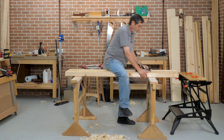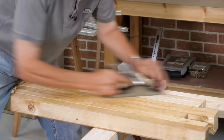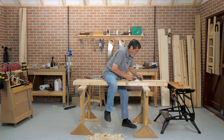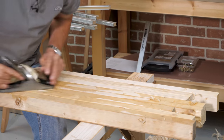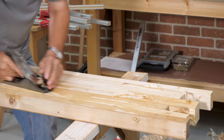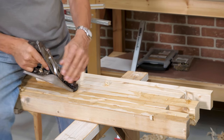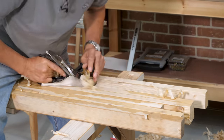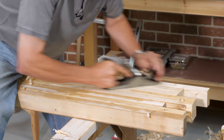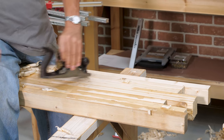I'm going to pick the best surface that I end up with. It's still a little too long yet, but the first thing is I'm going to go across my grain here like this. So I'm working kind of catty corner because it's easier. I may vary as I go, but this will take off the high spots very quickly. And once I've got these nearly to level, I can start winding it in. See, this one is quite a bit higher than the other ones around it. Again here. So we just keep working this surface like this and work it down until we get near to level.